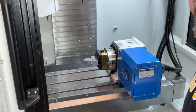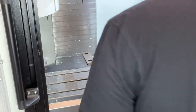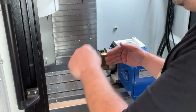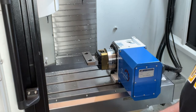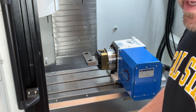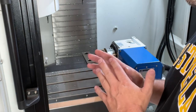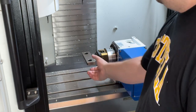One other option: if you don't want to program from centerline, you can just put your part in the vise, set G54 anywhere, take your first set of cuts, then after operation one roll the part over, set a new work offset on your freshly machined features, call that G55, and you're good to go. A lot of this depends on user preference and how accurate you need to be. If you need absolutely precise parts, sometimes running two separate work coordinates lets you ever so slightly adjust work coordinates two, three, and four based on machine growth, temperature swings, and temperature variations in your shop.